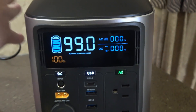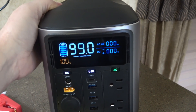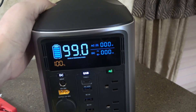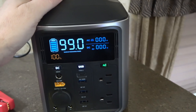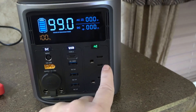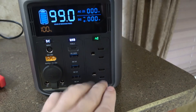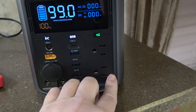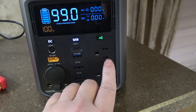The battery we're recharging is actually a 740 watt-hour battery, which equates to around 60 amp-hours, so it's a fairly hefty battery. It also has built into it a 600-watt pure sine wave inverter which can run quite a few things. It can't run really high wattage things like a microwave, but it can run any TV, CPAP machine, computer, or a lot of smaller wattage appliances and fans.